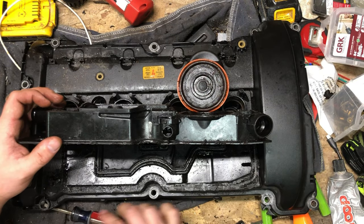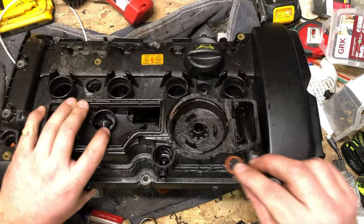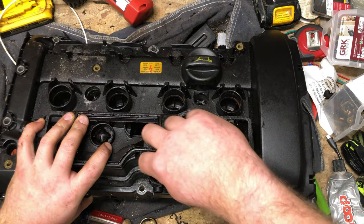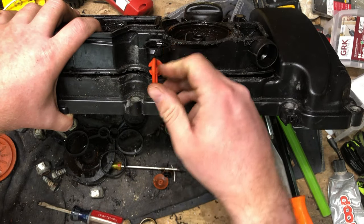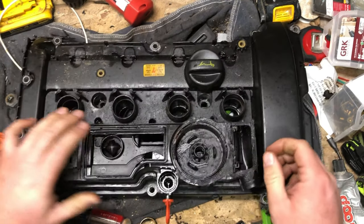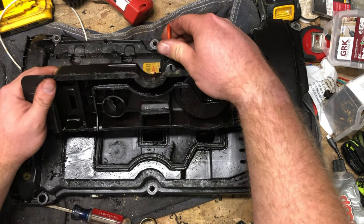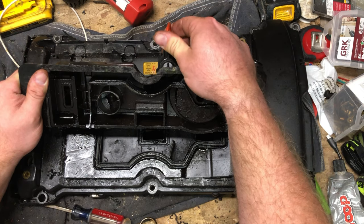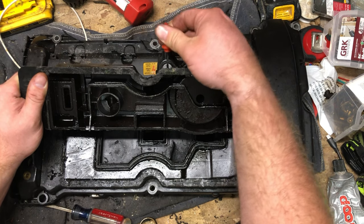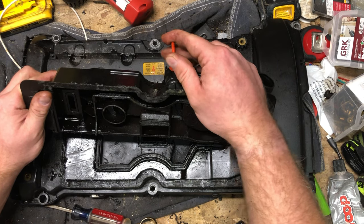I think that this guy on the back here is an emergency blow-off valve. There was a fairly beefy spring sitting on top of this, and then this plug sits back here. It's not screwed in or anything - it's just a pull plug. So if something goes wrong with this system, something clogs, and the pressure builds in here, this has the ability to pop off and vent. It has to overcome that spring and pull this out, so that's actually quite a bit of force in order to do that.